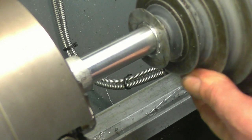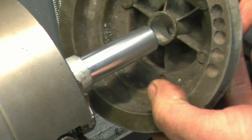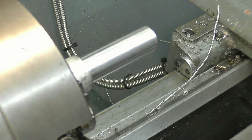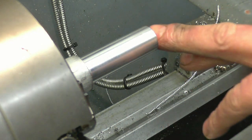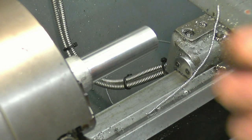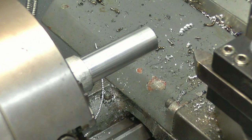I basically think that will draw now. I'll warm this up and that should expand it enough to get it in. I need to put the chamfer on this end and I want to centre this end before I take it out of the chuck, which will make it much easier for me to set it up fully. Put a little chamfer on the end.